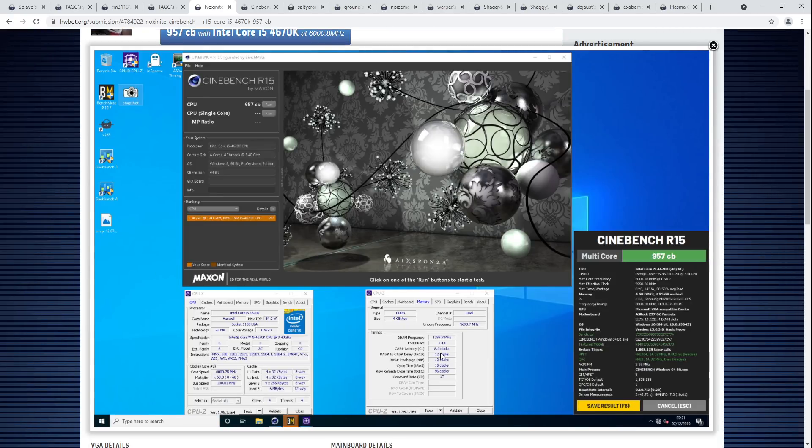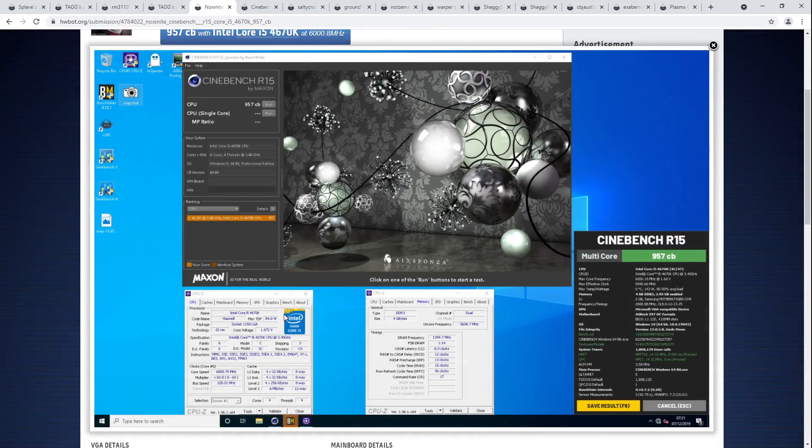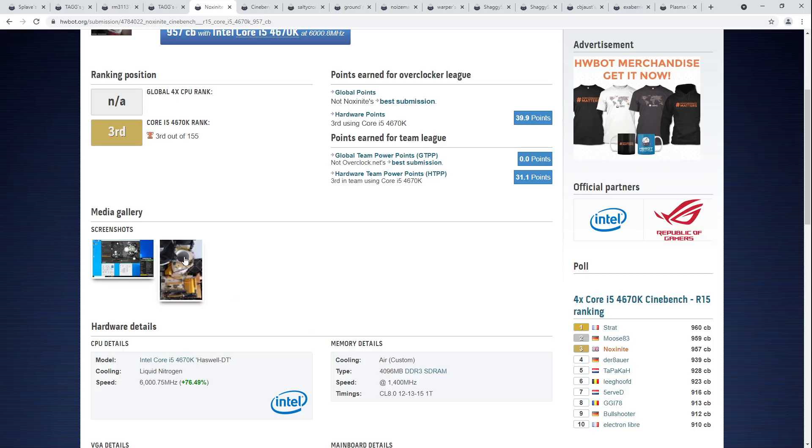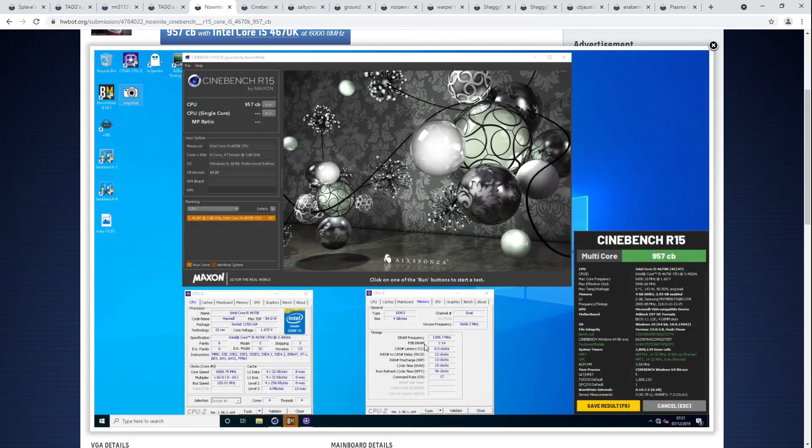It's just really cool to see this sort of arguably obscure memory chip. If you're into competitive overclocking enough, you should have probably heard of Samsung G-Di by now. Nobody ever made retail DDR3 2600 kits with it even though it would do those clocks very easily — they just would have been 2 GB sticks and nobody would buy them. If you want G-Di, you're stuck buying OEM sticks rated for 1600 CL9, but that doesn't stop those sticks from doing crazy overclocks and producing massive Cinebench R15 scores.